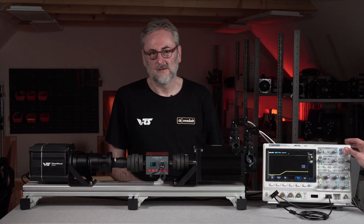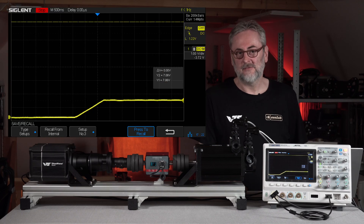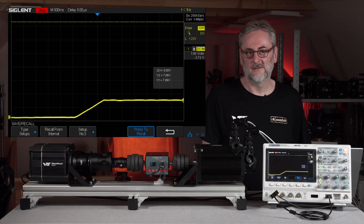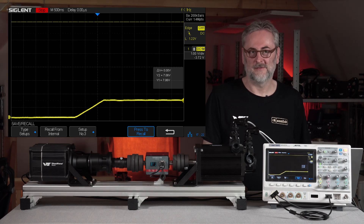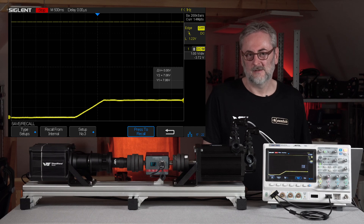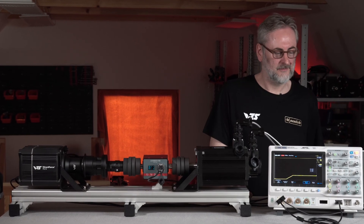You can see it already made it. Let's now have a look at the screen. You can see on the top a dotted line indicating 50 newton meters — that's the maximum that the DFB15 can do — and the beginning was zero, so you can visualize the span going from zero to full. And you can see the 5 newton meter line. Watch closely — you can barely see this 5 newton meter line show any ripple or lack of smoothness. But still it's there, like nothing is ideal. This is a real device.